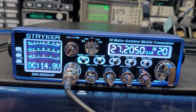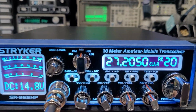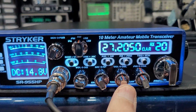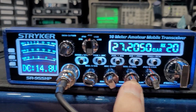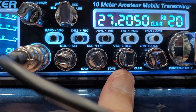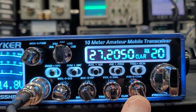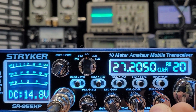receive and transmit. We have an upgraded echo board that is actually out the face on this one. So you can control the amount of the echo with the small control, and you can control the speed of the echo with the back control here. Speed set somewhere around 8 o'clock, and then the amount somewhere around 12 o'clock. Yeah, that is all set and done.